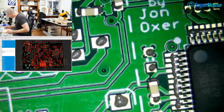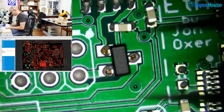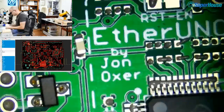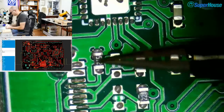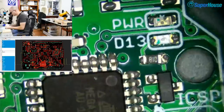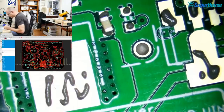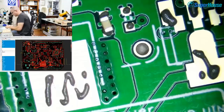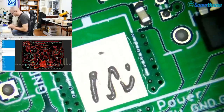So, what else do I have? I've got an FDN here. At some point, I'm going to have to look up the overlay for this board and see what parts are actually meant to go on it. These ones I just put on because I happen to know what they are. They're obvious. It's a bit hard to miss the CPU, but many of these other parts, I don't know what they are, not without checking the positions. So while I'm here, and to get them out of the way, I'm just going to stick the big fat voltage regulators on there.